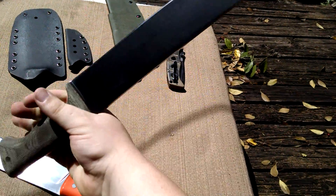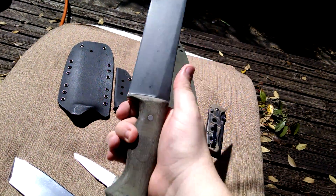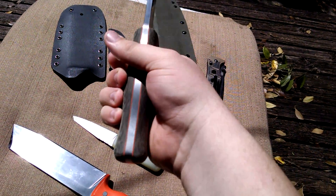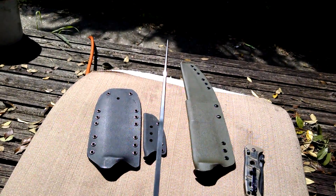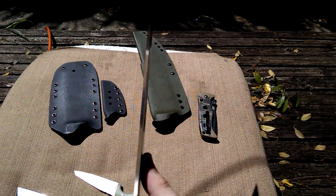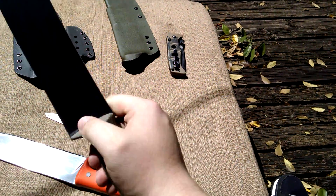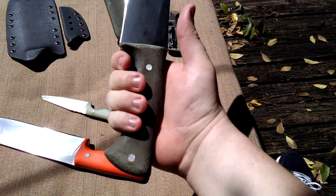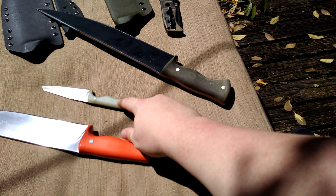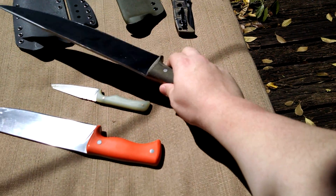This big one is still 5160 with black Cerakote. Quarter-inch thick, no tapered tang, so this is still the same weight, although it does have a taper up towards the tip. I'm not really positive about the thickness behind the edge - I would guess at least 30 thou somewhere around there. Black micarta handle scales. I forgot to say - G10 handle on that one, and obviously orange G10 on the Cleaver. All Kydex sheaths.